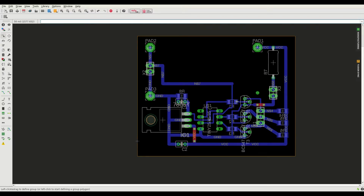Yeah. What else? This is where the boost converter sits on a little piggyback board. The 7805, I chose to lay it down on a board and screw it to this. First of all, it dissipates a bit of the heat away. Not that anything is really heating up too much with the 5 milliamp load, but I don't want to have it flying around inside the flashlight. This is potentially a case where it's a flashlight, you're going to drop it, and you don't want it rattling loose. Just screw it down, you'll be fine.